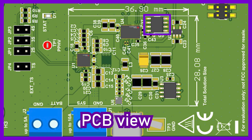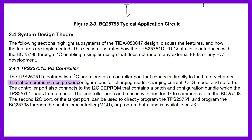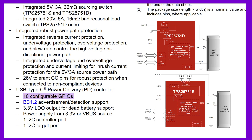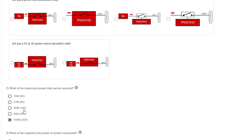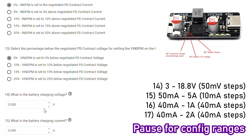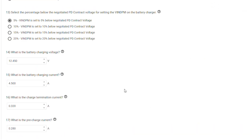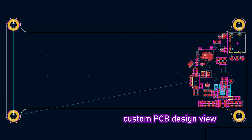Since with the EEPROM chip on board, you can configure pretty much everything about this system — charging profiles, wattages, power roles, communication protocols, and there are even GPIOs on this thing, and a lot of them too. And just in case you think needing an EEPROM chip for configuration is bad and you'd rather the competing hardware-configured alternative, generating this software for our EEPROM chip using TI's GUI takes literally a few seconds and is orders of magnitude more versatile. So it was safe to say at this point, I was sold.